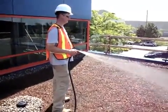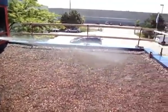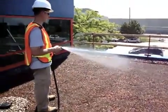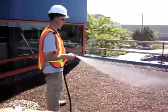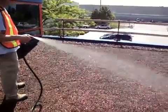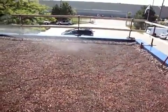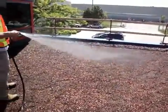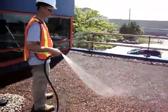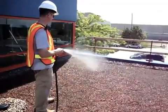What we're showing here is the growing medium being watered. The idea is that the growing medium allows water to shed through — it will shed through down, through the geosynthetic, into the MS-20. The MS-20 cups will now fill up, and they also provide water retention and a reservoir to give water to the plants when a drought does come. And if too much water does come in, water can still get through the perforations, as we show at the start of the video.